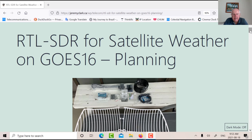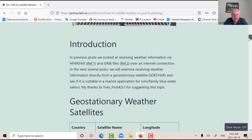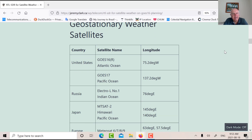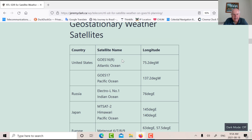We'll quickly go through the blog post on RTL-SDR for satellite weather. This first post covers the planning of receiving signals — we haven't assembled the antenna or received signals yet. There's a list of all the geostationary weather satellites. By geostationary, we mean the satellite is in the Earth's equatorial plane where centripetal force is balanced by gravitational force — so it sits in a stationary orbit. Going further out it would escape into space; further in, gravity would pull it down. The satellites shown are from the US, Russia, Japan, Europe, China, and India.